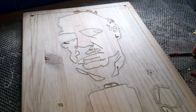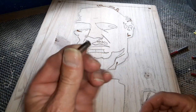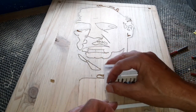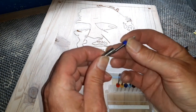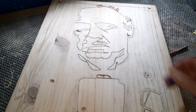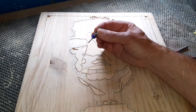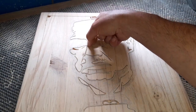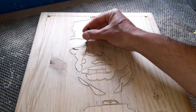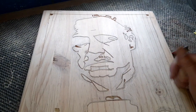Everything's done with the CNC bit — that's it finished. Next stage is to remove it from the 6.35 millimeter adapter collet and replace it with one of these end milling bits from eBay or Amazon. Pick one that's a nice size, slot it back into the adapter, set it to three millimeters depth, and start clearing out all the smaller areas. Because we've already separated the wood from the side of the nose with the shaded area, it will pop off nicely without doing any damage. That's the reason we go around with the CNC bits first.